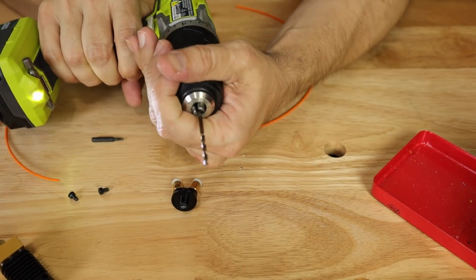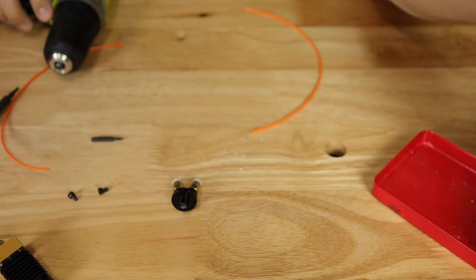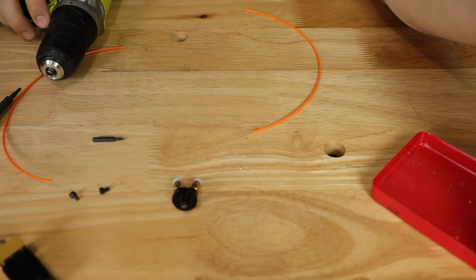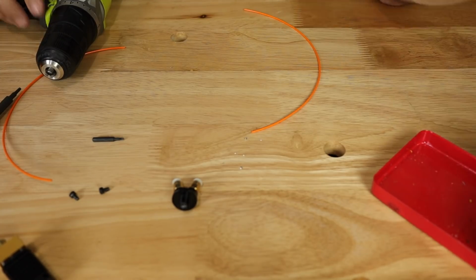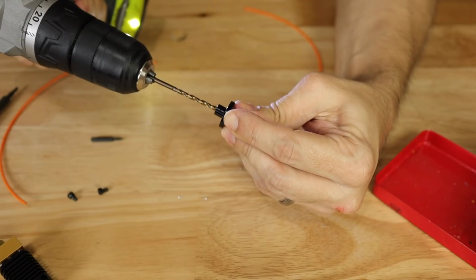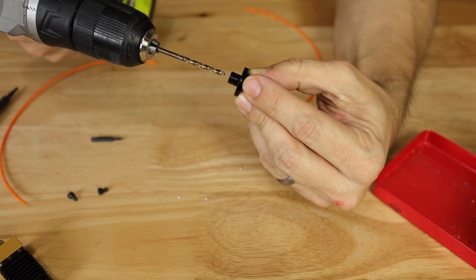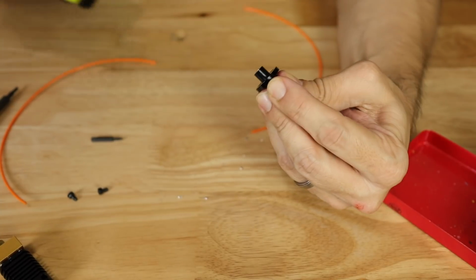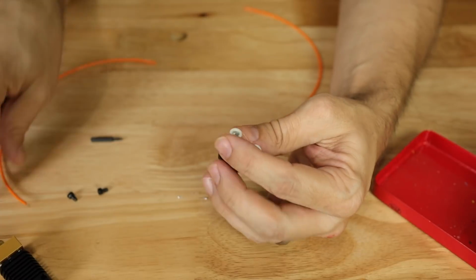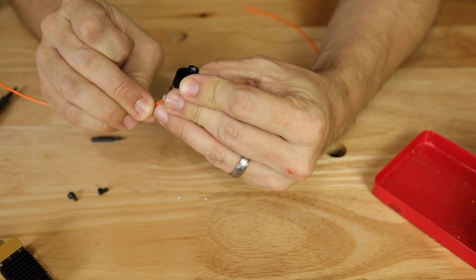This drill bit set, I will see if it's still available and link to you in the description. This is a metric set I got off of Amazon. That was 3, and then it nicely steps up to 3.2, which is going to be just barely bigger. Since it's going well, I'm going to go a little bit faster and try to clean that out. Let's see if that helps. That is almost there.